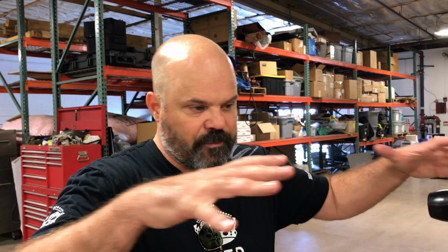I just ordered a really cool new machine that does blasting. It's a big round tub that turns slowly like an old-fashioned dryer, and inside of it are these round pebbles, and it's got two big jets blasting media in, and the parts float around in there. So I can unload a batch of parts and not have a poor guy standing there getting stinky vinegar hands while he's blasting on the thing. It blasts the parts over a cycle, stops on its own, and then unloads the parts. So it'll get us this really nice, consistent blast finish without a bunch of little prang marks and ping marks from them bouncing around on each other. So I'm really tickled about that.